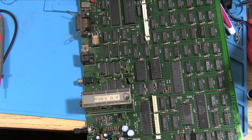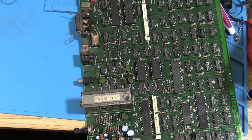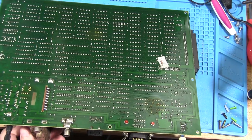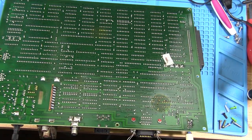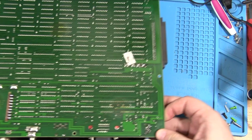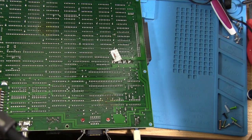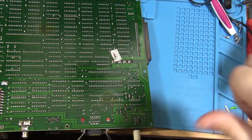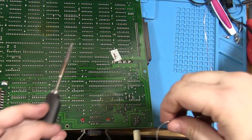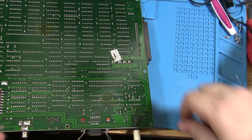What we need to be doing is adding more solder to the tantalums first — this is always the fun part of working out where the components are. We add more solder so it's easier for the old solder to flow, because old solder has generally dried out and doesn't flow as well. If you add fresh solder to it, that will just help it come out easier.